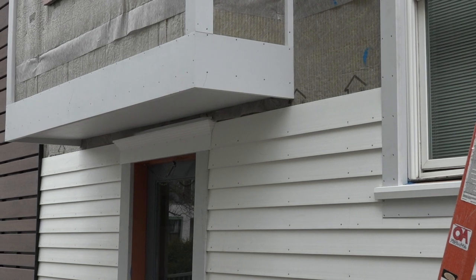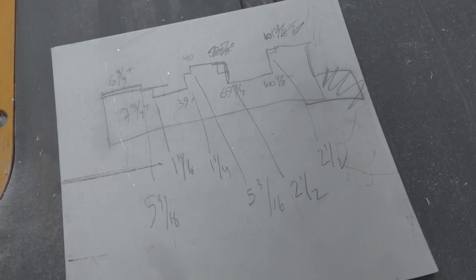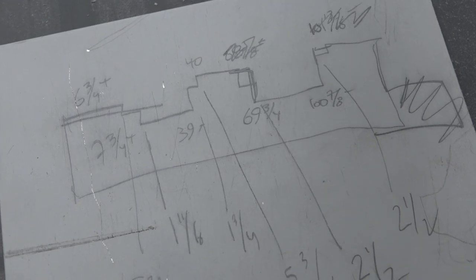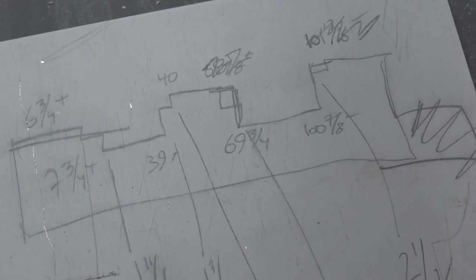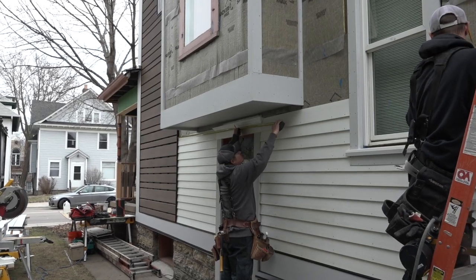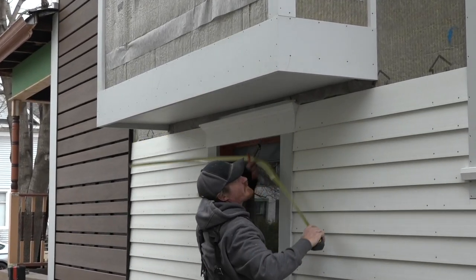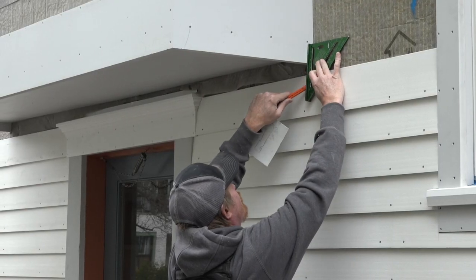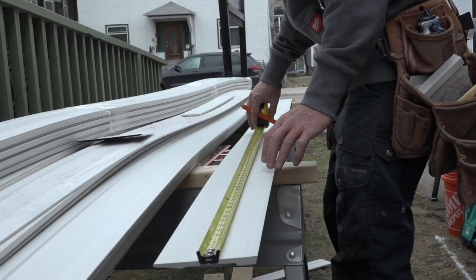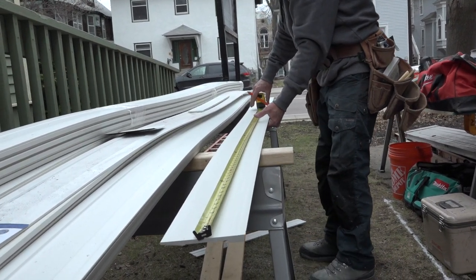The notching process begins with a full bucket of patience. Step two is to draw a map of the terrain to be covered. It doesn't have to be pretty, but it does have to be accurate. One critical piece of accuracy is double-checking things. Another is having an intelligent system of operations, like pulling numbers from the same place for the whole workpiece, scribing both sides of an obstruction, and drawing known spots for reference. Of course, a lovely flat work surface is helpful too, but, you know, it's a job site.